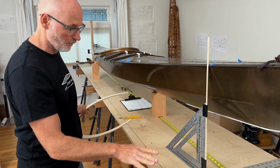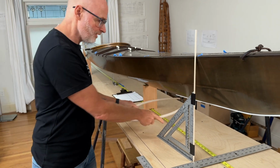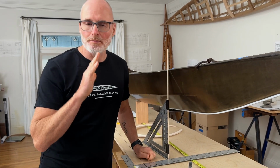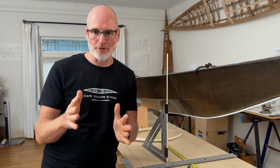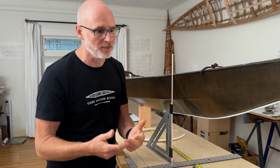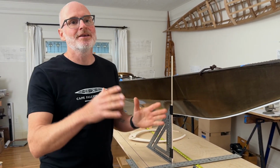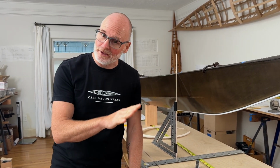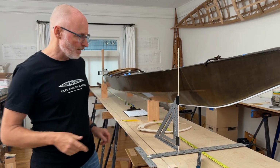And that's the most important thing that I want to say about this whole setup. The reason that I take the accuracy so seriously with surveys is that just the process of surveying and reproducing boats inevitably creates errors, because we're going to survey this full size and then we're going to draw it up at a smaller size, and then somebody in the future might want to make it again to a bigger size. And just the line width from drawing and redrawing things, even if you're just working from the same table of offsets, things can start to creep as far as the actual measurements. And so the best way to fight that is to start with the most accurate possible survey that you could take. So just to give you an idea of how this works,